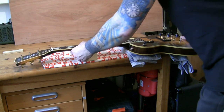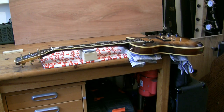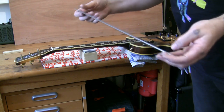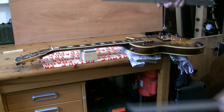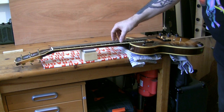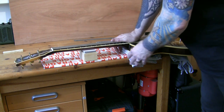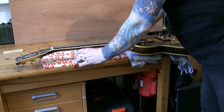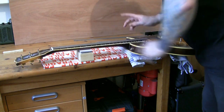What we're going to do is let that rest, and we're going to take a steel strip of metal - I bought these just for this purpose. We've got two of these: one 30 millimetres wide and one 25 millimetres wide. What this enables us to do is get some heat into the fret area. I'm going to use the wider one. So we need to clamp here - we're going to put the bend probably right here, just there. We've got that laid on the neck; I'll explain why that's there in a moment.